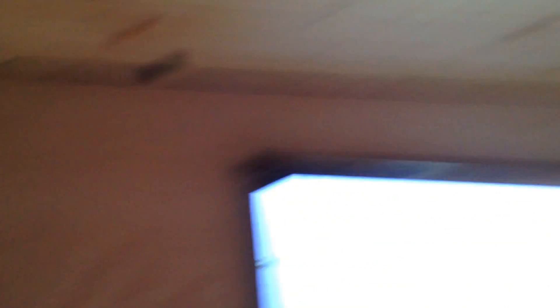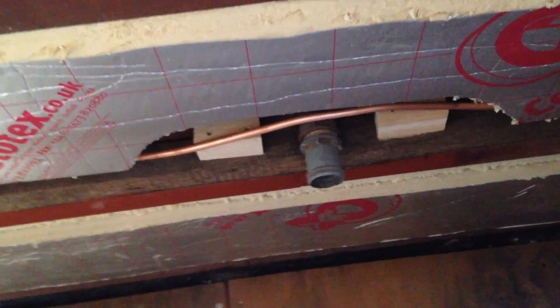Around the corner to the bathroom area, I'm cutting a board to size to fit in there. Behind it I'll drill a couple of holes to let the wiring through, the sink outlet, and the shower pump outlet. There's a cavity with spacing, and the wiring for the light switch runs down there — and it works. There'll be another sheet of plywood to box it all in, which will also disguise the wiring. I've still got a bit more insulation to do and I haven't finished securing the gas pipe.